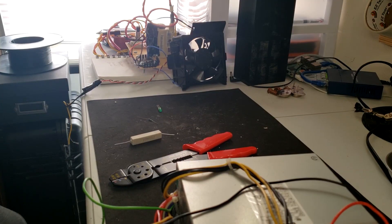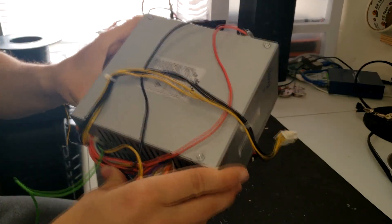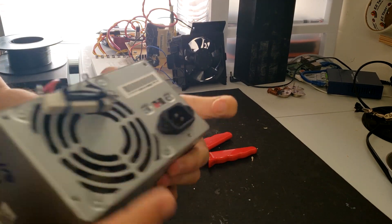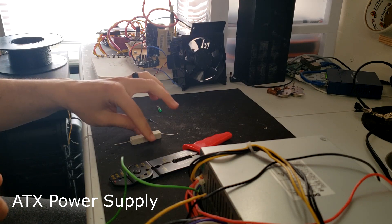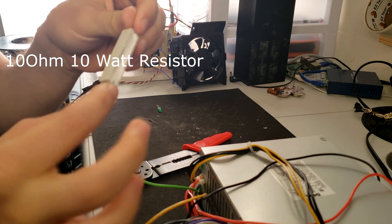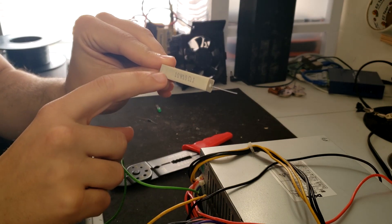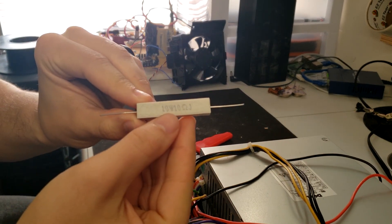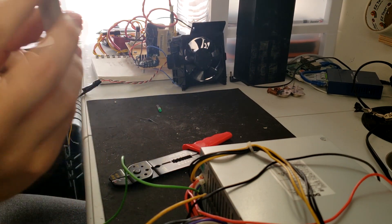The big requirements are obviously the ATX power supply and a power cable for it. The second thing you'll definitely need is some type of load — this load needs to be about 10 ohms and support roughly 10 watts of power. I'm using a cement resistor; as you can see it says 10 watts, 10 ohms. I'll provide a link in the description if you want to buy one, and we'll explain what we need it for later.